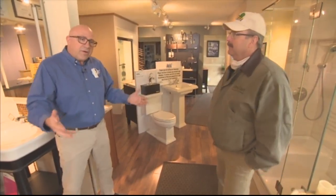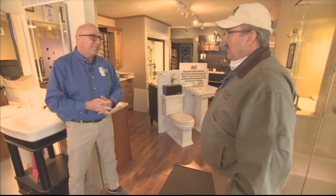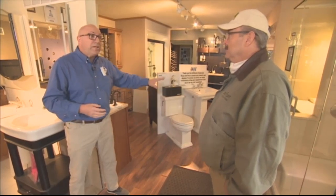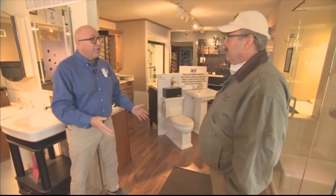We are. I mean, I always say people keep on flushing, so they're going to need us to keep that water flowing for them. And you know, as I walked around here, a lot of these fixtures are operable. So when you do reopen, prior to that, you're going to have to safely flush out your system, right? Yeah, that's something we take very seriously, how we're going to do that. We have a plan in place of how we're going to start at certain fixtures at the lowest point and work our way up to make sure that we completely replace all that bad water with good water.